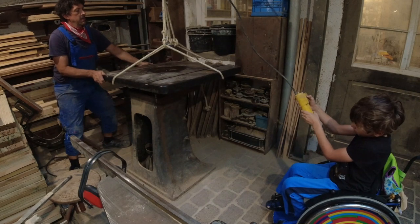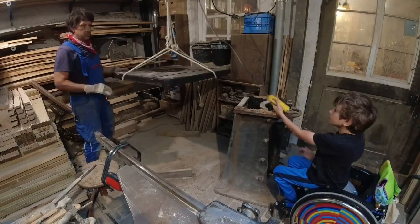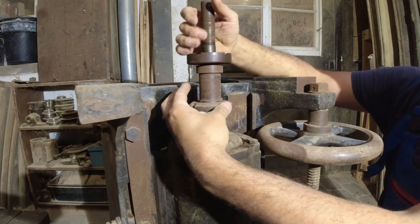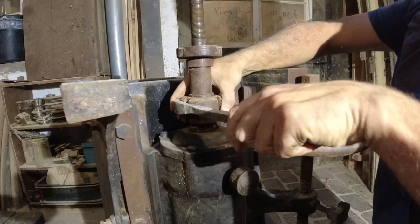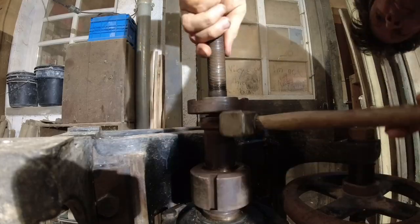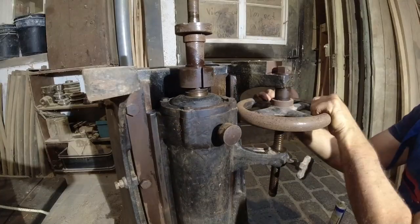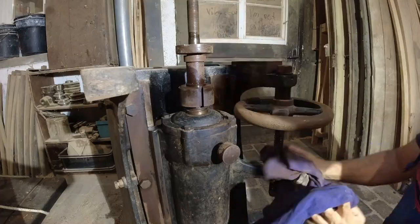We attached an electric winch to the roof construction, and then the table came off easily. It was only now that I realized the spindle consists of a spindle part with bearings and a milling arbor inserted in it. The nut holding the milling arbor could be opened easily with the special tool. I removed the flange washer and an intermediate ring, and tested the height adjustment of the spindle — a very massive construction that still works perfectly.